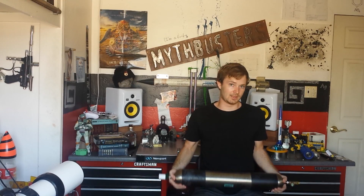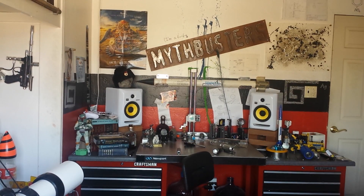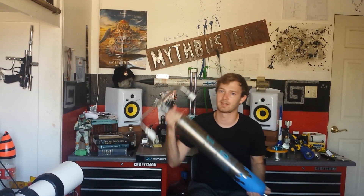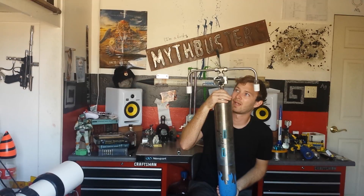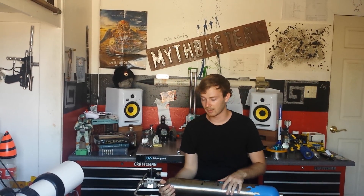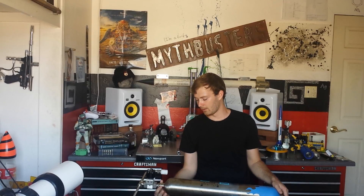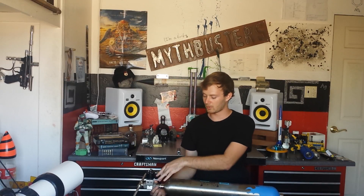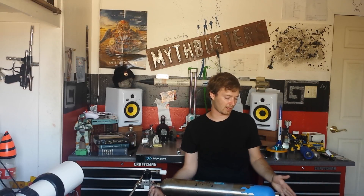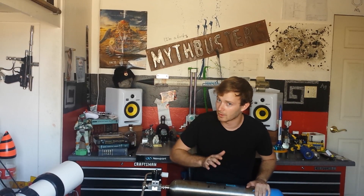I also have a steam rocket jetpack, so I'll bring that up. You can see I have several videos that also show the success of my steam rocket jetpack. This one is a very similar tank — it's a one gallon tank — but it has larger port sizes to accommodate for a larger volume flow. It actually has a siphon tube that goes all the way down to about here. What it doesn't have right now is the pressure relief valve, so it's open right now because I'm working on it.